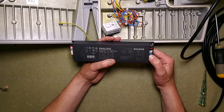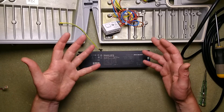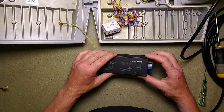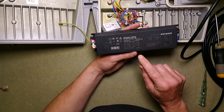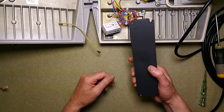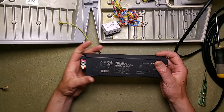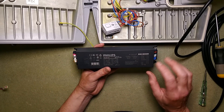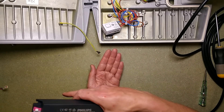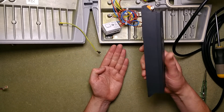DALI is a communication interface used in the lighting industry. It's a very low speed, ruggedised network designed for controlling lights in office buildings — not like DMX where it has to update at very high speed, just a simple low-speed system for turning lights on and off. This also has a little antenna symbol that says 'Simple Set', which is a system for programming these drivers contactlessly. When you place the pad on the driver and touch it, the green light lights up and it's programmed.